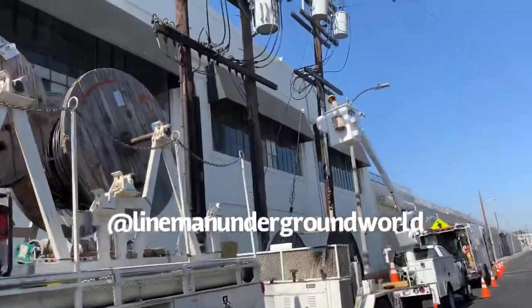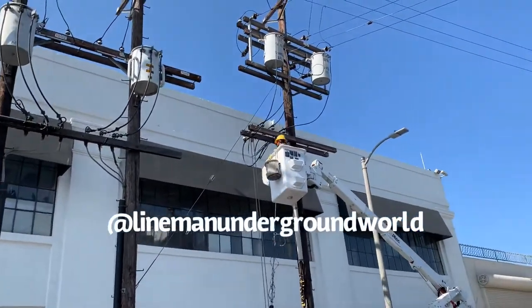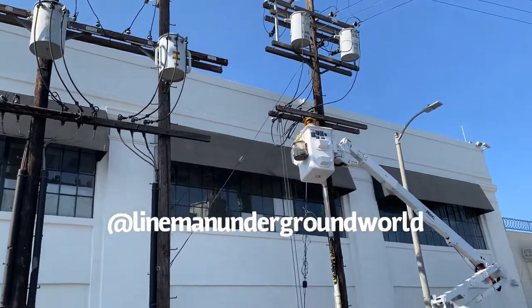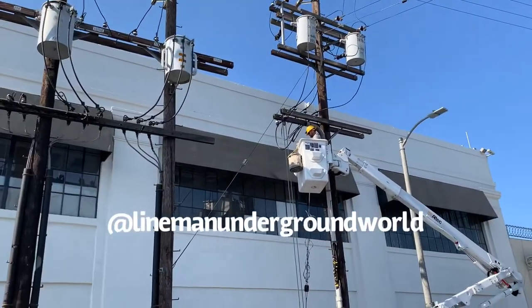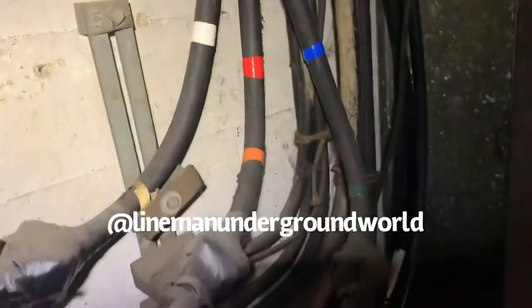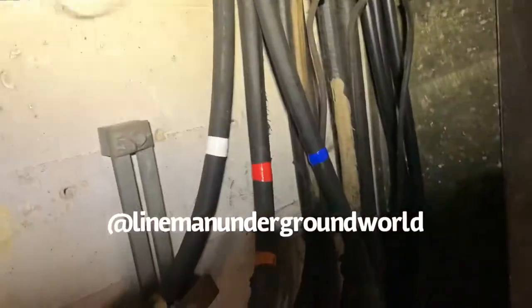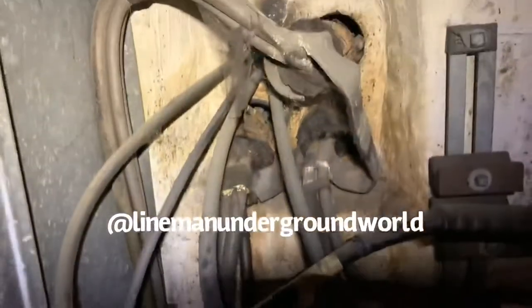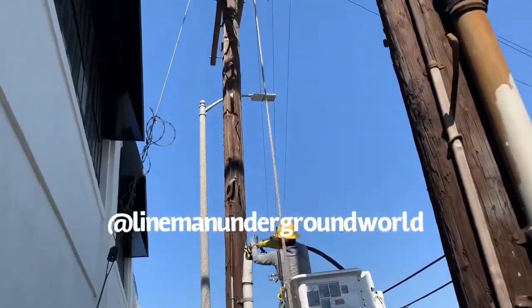All right, so we're outside again. We got two banks here for lights and power over there, and he's going to take rotation there before he cuts it in the clear, so we can pull that damaged cable, as you can see right there. Stand by. So finally, we got our rotation, we got our legs all taped according to our rotation meter. And this one was our neutral, which is not being used at all. This one is just the three phase that we're going to be working with. So we'll be cutting and then re-taping and checking rotation. That's what we got going right now. All right, she's coming down and we're going to be pulling it out and fixing the riser and getting her pulled in.